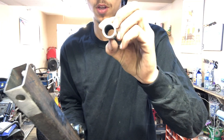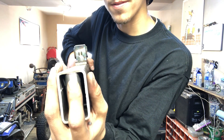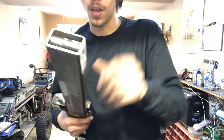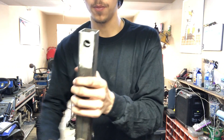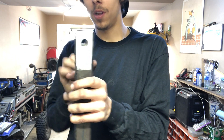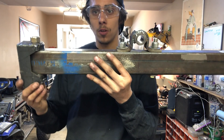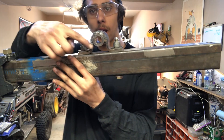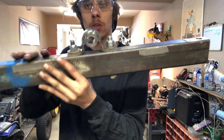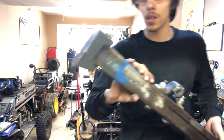It's got like no play whatsoever, but just because I like doing things overboard, I laid down this 5/8 tube bushing and I'm gonna pound that - it just perfectly slides in there - then goes in and I'll pound that right into position and weld it, then cut off the ends here and round it over. You can see that's going in there and then I'll be able to put the bolt right through - that'll be a nice tight, no moving, no nothing. The only other things I have left to do are spindles, and I want to fill this gap in because I don't want my pivot point trying to pull off the welds.